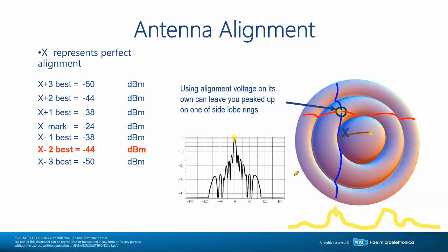The key is that you count the number of peaks: one, two, three, four — and there would be five and six. If you get an even number of peaks, you're on a side lobe. If you get an odd number, you're on the main lobe or able to get to it. If your sweep gives you one, two, three peaks, tighten at the highest peak, go in the other dimension, and you have the center. If you get an even number — one, two, three, four — go to the lowest value between the two center peaks, then go in the other dimension and hit the center. It doesn't matter if you try this vertically or horizontally — it's the same because a parabolic dish antenna is circular and has the same performance. That way you will find the center of the main beam.